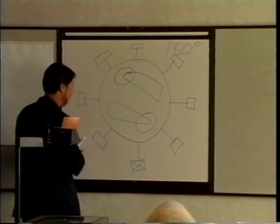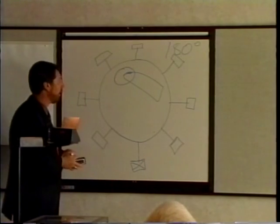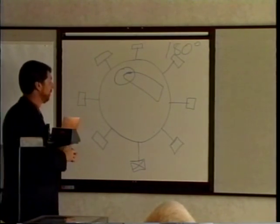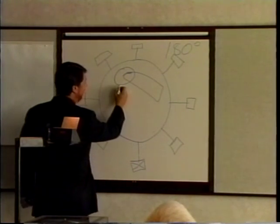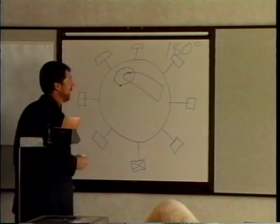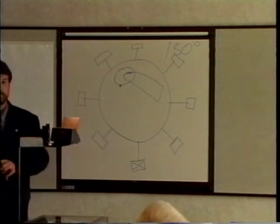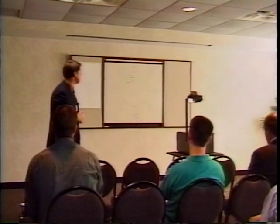So then you let the power off the watch, put it back in the exact position where you had your fastest position, your fastest rate, and then that lowest point on your balance wheel is where you remove the weight. Okay?